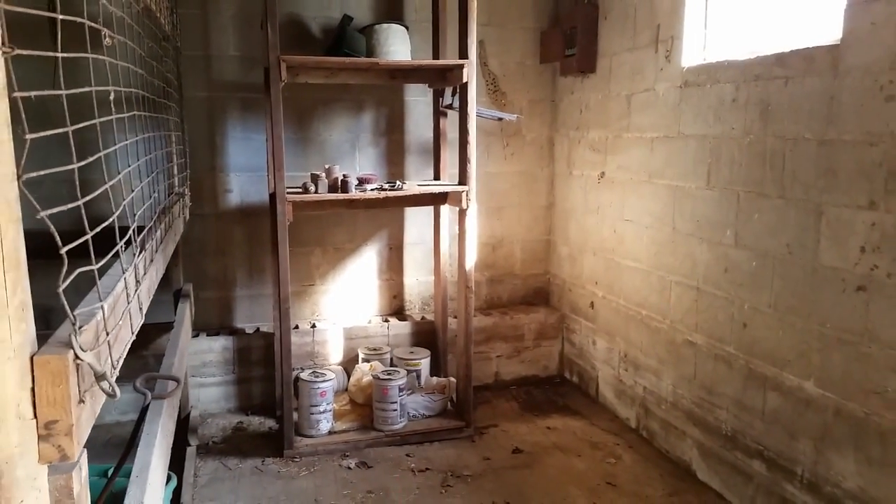I'm going to put a new post here to help hold this together, but since that center board isn't really doing much good anymore, once I level this out I'll scab a new board on this side and on the far side and nail it all back together - something to connect the left side with the right side. Hopefully that'll help once we get this jacked up. My wheelbarrow has flat tires so I'll just go ahead and give it a shot anyway.